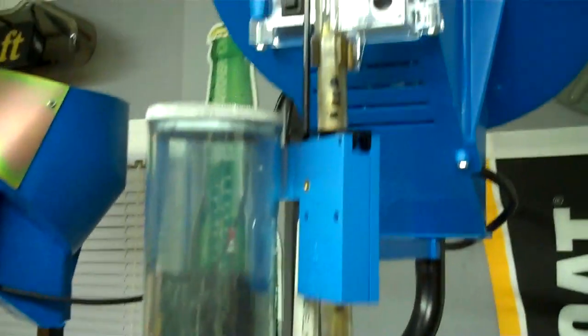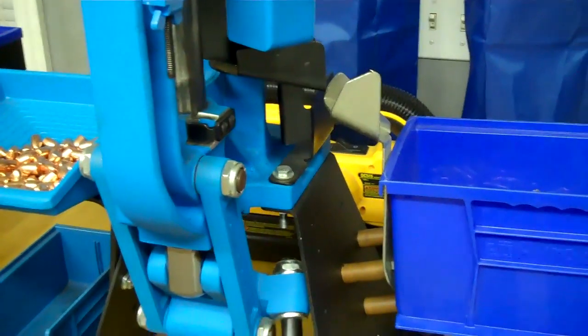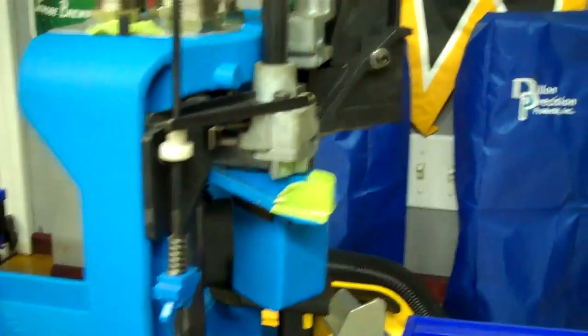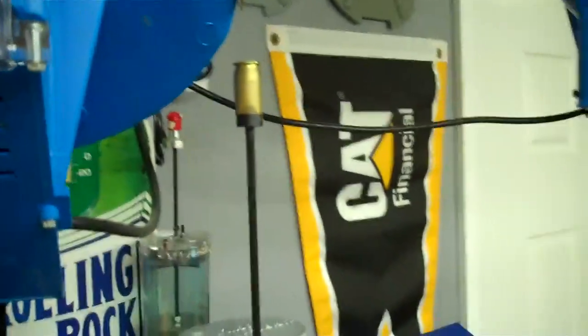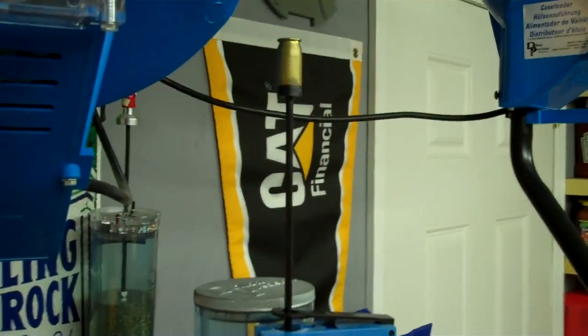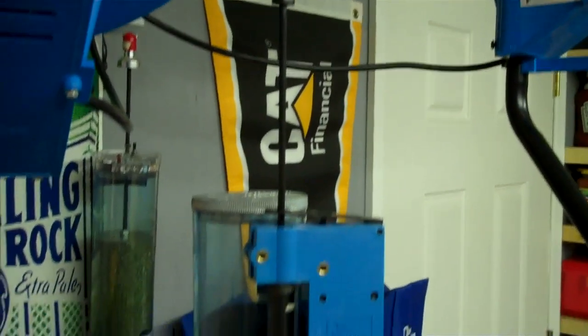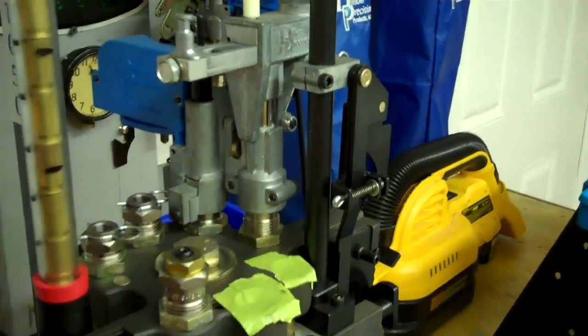Now for primers. On the 650 you don't really have to watch that rod too much. One of my biggest tips is to put a 45 shell on the primer rod — it fits on there perfect. Do that on both machines. On the 650 you install the primer on the end of the forward stroke so you can actually tell whether you put a primer in or not. On the 1050 it actually does it on the down stroke — you have no idea whether it does it or not. My biggest piece of advice is to look at that rod every now and then and make sure it's dropping every time, otherwise you can end up with a whole run of ammo that did not get primed.